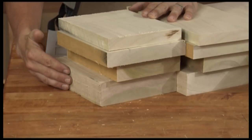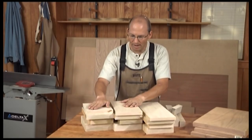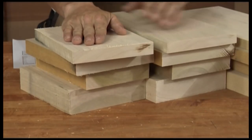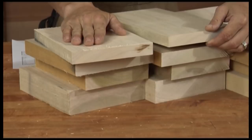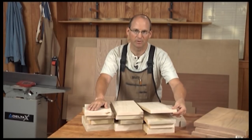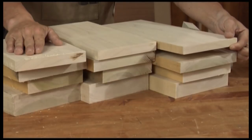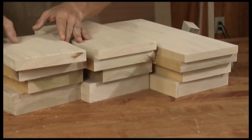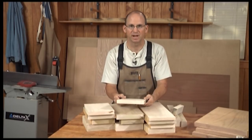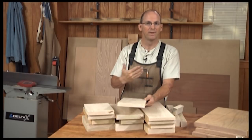As you can see, eight quarters is two inches thick. Here are my different options. What I yield from this material is, for example, here's a piece of four quarter that I've run through the jointer and planer and now it's seven-eighths of an inch thick. If I went to the home center it's going to be three-quarters of an inch thick. So here I've lost a full quarter inch of material. But with material this nice I can make a seven-eighths inch tabletop — that little extra thickness takes advantage of the options as a custom woodworker.